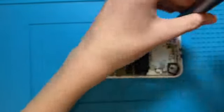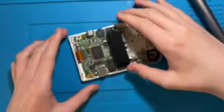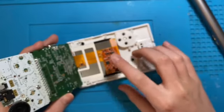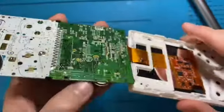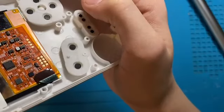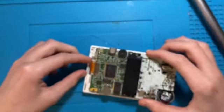Let's continue with disassembling this. There is a bit of damage to the shell — some exposed copper around this screw, which is never really good. That might have something to do with it. Pretty sure that's meant to be covered up and also stuck down to the back of the screen. These pins haven't even been cut — I think these pins are meant to be cut, otherwise they can just puncture the ribbon cable. And actually, if you look on the screen connector, it's got a big mark in it there, which is probably down to that ribbon cable.